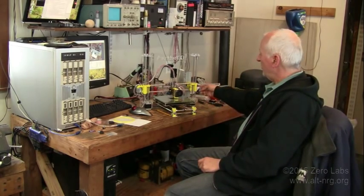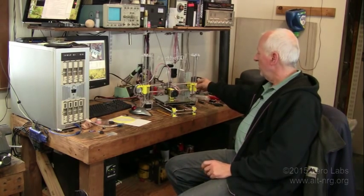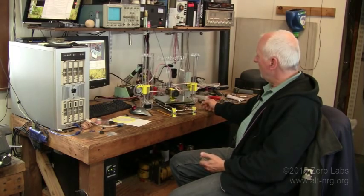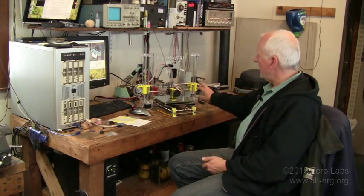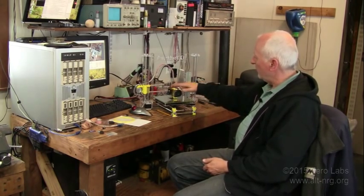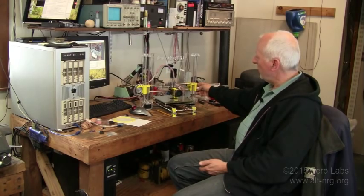That was the mechanical assembly. One thing I do need to replace on the printer is the Z-axis linear bearing slide rail mounting bracket — it was rather poorly made by the supplier. It is not square at all and the second slide bearing will not go into the housing to allow the X-axis rails to be level. I'll point that out in my final review. What's printing right now is a replacement for that piece. Now that I've got calibration errors out and everything dialed in, it's printing directly from an SD card — no longer connected to my computer. The mechanical assembly is done, so let's get right into the wiring video.